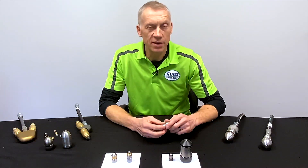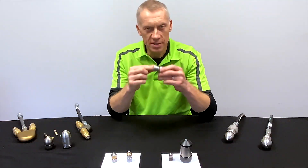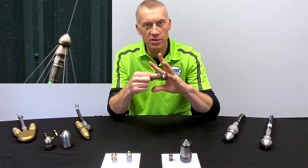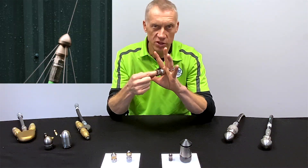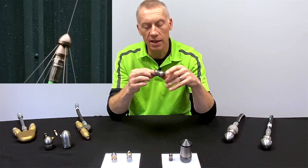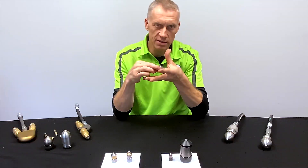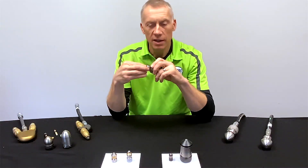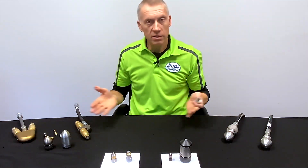First, real simple: what's the difference between a rotating nozzle and what I would call a standard static nozzle? Here's an example of a classic penetrator static nozzle — it's got six rear jets that are not being rotated or moved in any way, just a stream of water. A straight stream of water actually has the highest impact, but as you're spraying that water out there are gaps. When we rotate those jets, we get 360-degree coverage of the pipe and leave no gaps in the cleaning.